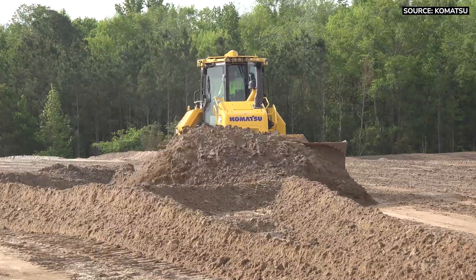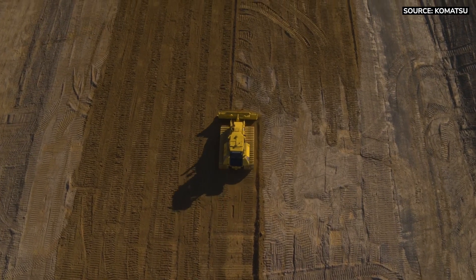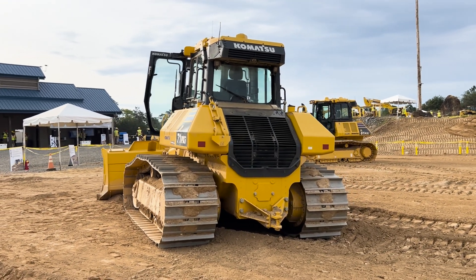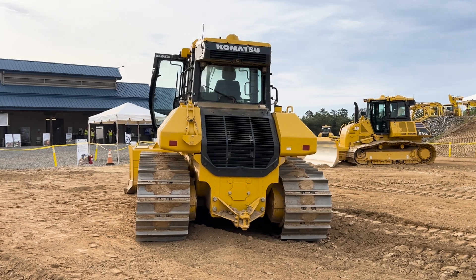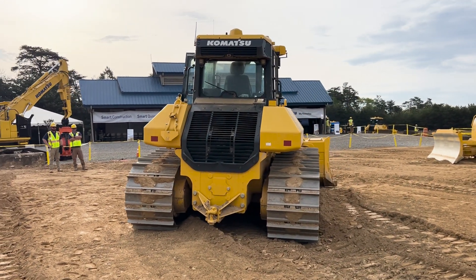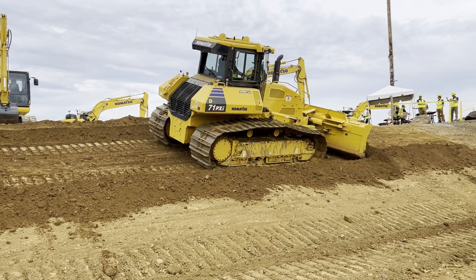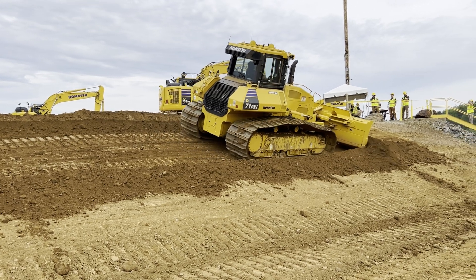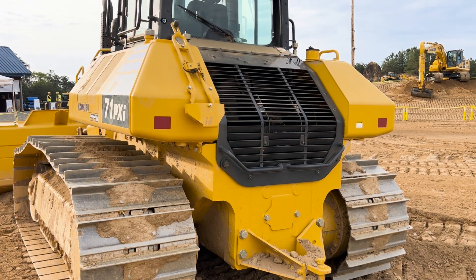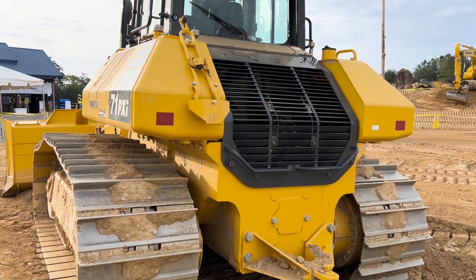With a radiator in front in dusty applications, when the fan kicks on it kicks up all the dust. We don't have that issue because our fan is in the back, so you don't have visibility blockage from dust popping up in front of you. All the coolant packages are in the back now, pushing everything out the back. You also get visibility off the back with everything tucked underneath the operator. Take two bolts out, the whole actuated panel comes up, and the electronic-driven fan can actually blow backwards to help clean it out as well.